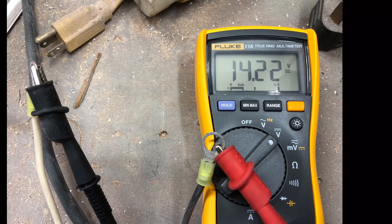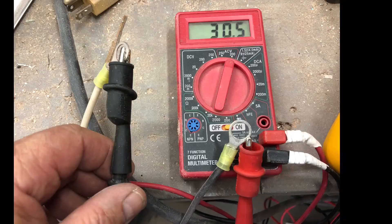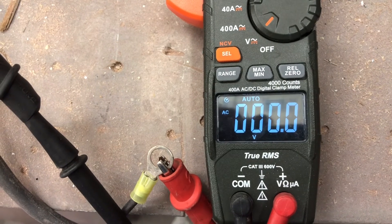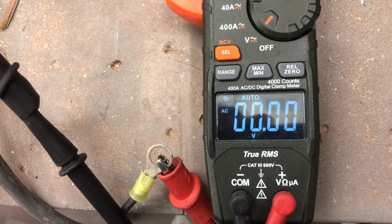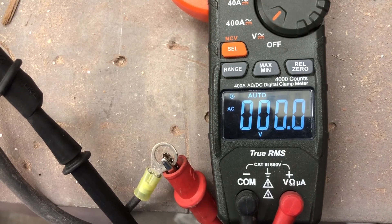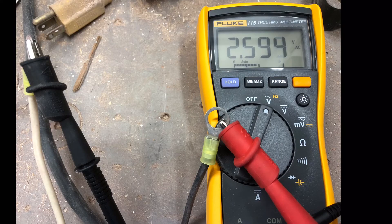To test for this you need a good meter. Here's a meter showing 14.2 volts DC off that converter, but this one here is saying we have 30 volts AC on it, so I'm not sure how accurate this meter would be. It's showing 14.2 DC but on the AC side it's doing this, so I'm not sure from this if I've got AC ripple.